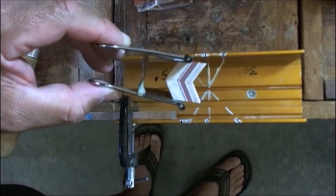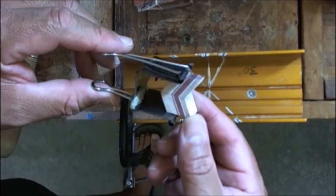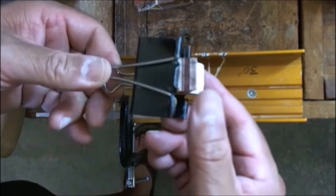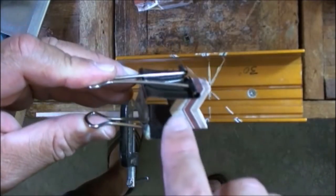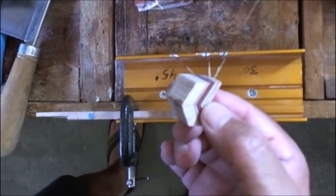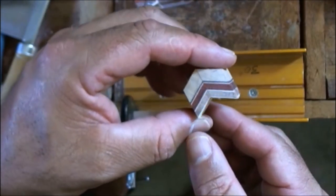Okay, these pieces are dry now. I just used the binder clip. I just dry fit them together just like I did on the actual blank itself. I put a couple drops of CA glue in the middle, let the glue seep down, put on both sides, and then let that cure. I didn't add any accelerator to it because it already had accelerator when I laminated it together, so that was actually enough residue that was there to actually cure that. Not immediately, but it took about 10 minutes or so for it to dry. So anyway, those are both done.